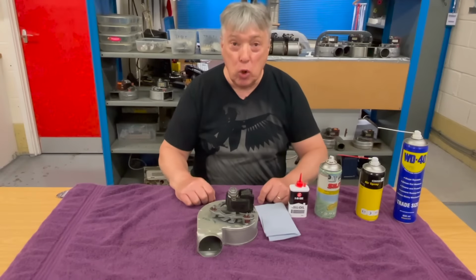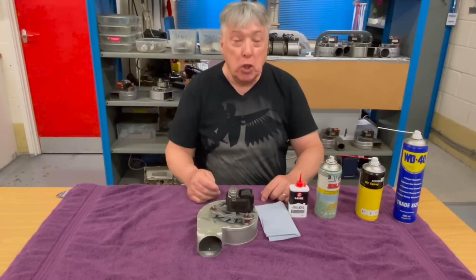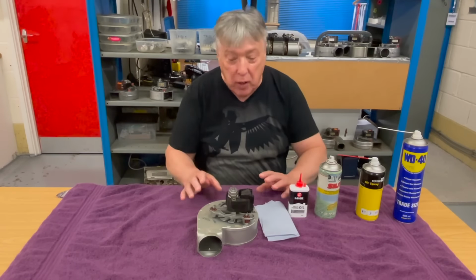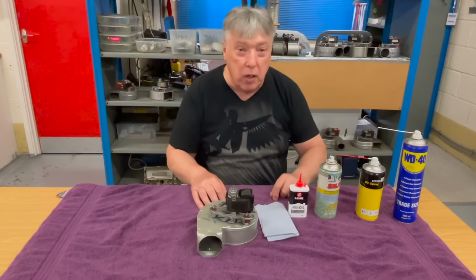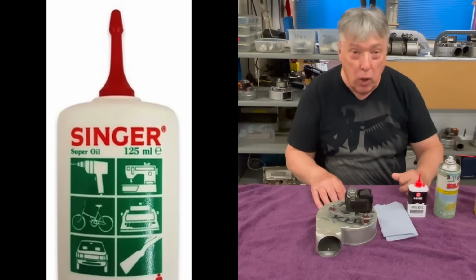So what we're going to do is try and rescue this fan because it could be Christmas, merchants are closed, and we need to do something better because it's not really good enough. It's iffy. Sometimes it will, sometimes it won't. So here are the liquids that we need. And don't forget, sewing machine oil is the one that we're going to actually lubricate with.